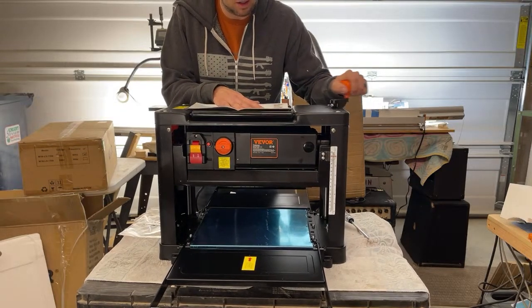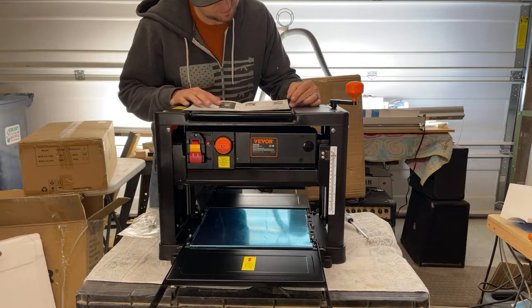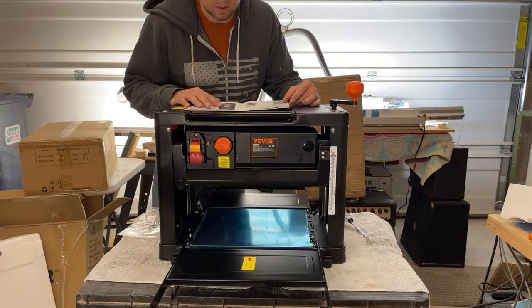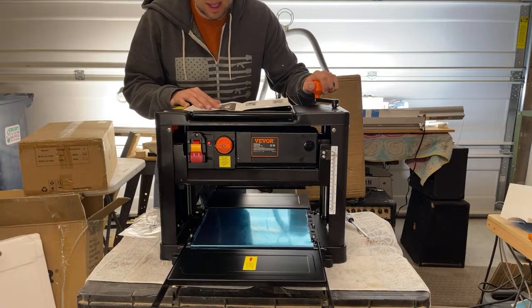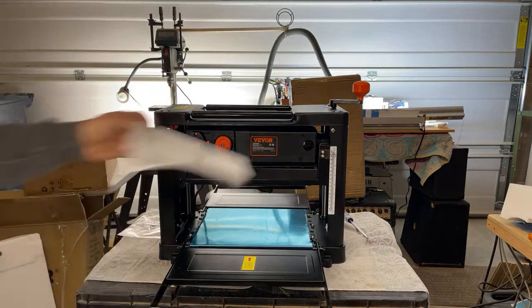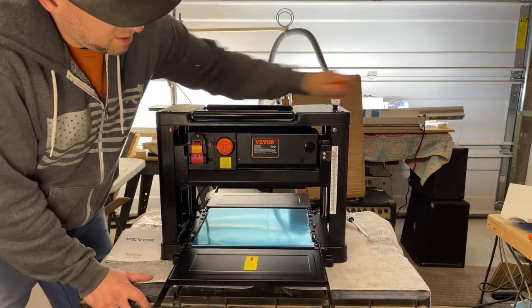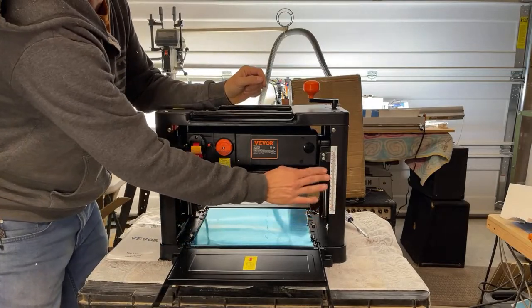Okay, depth of the planer, rotate the depth adjustment handle, speed controller. Yeah, so this is a speed controller is what it says. Please plane the wood a few times. Yeah, so this is just speed, and then you control the depth with this. There should be a little gauge somewhere that tells me what depth. Oh yeah, right there in the front. It tells me what depth I'm at. So you measure your wood, and if I'm going to do a fretboard blank, we're talking maybe 8 millimeters. If I want to take 2 millimeters off, I would just set this thing to 6 millimeters.